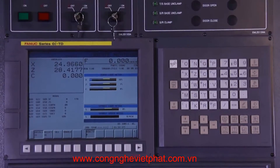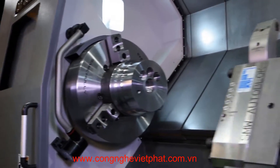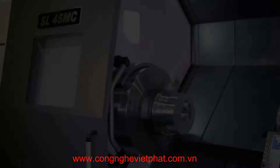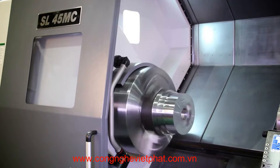The standard machine has a FANUC control. The main spindle has a bar capacity of 4.63 inches. The spindle nose is A2-11 with a standard 24-inch hydraulic chuck, a speed of 1,800 RPM, driven by a 50 horsepower FANUC motor.